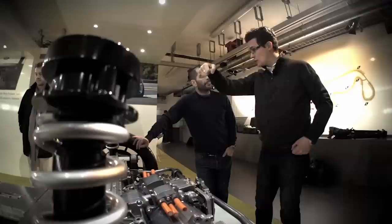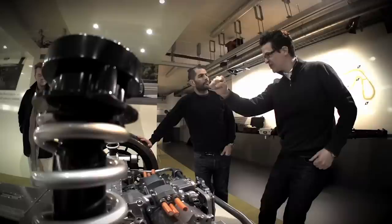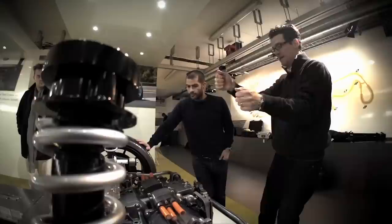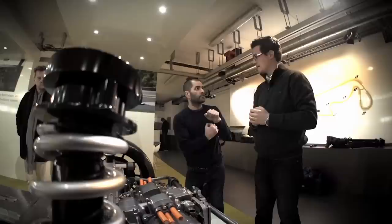If you rip it off and turn it backwards, then you lose the grip. Yeah. That's not what you want. So you kind of brake it down and kind of turn it backwards. And by moving this way, these two have maximum torque positive, and these two negative. This is how you can always imagine it. It turns automatically. But you're not actually running the motor backwards. You're just pulling the torque back to zero. Exactly, and that's what you call negative torque.